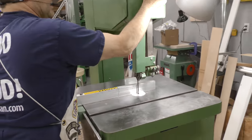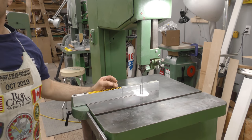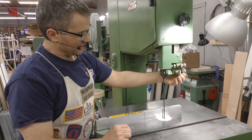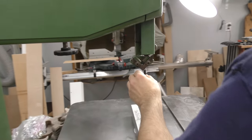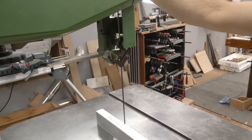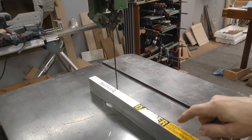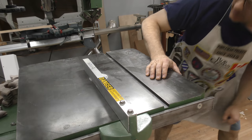They've got this weight that goes on a cord — a piece of steel wire around a pulley into a big weight down here, so when you lift the upper section, as heavy as it is, it's counterbalanced. Now I've got to make sure this thing is perfectly aligned — and it isn't. The guides need a little work. I'm going to try a block of wood, slice it off, to see if the bandsaw fence is set up and if this thing is running true to the fence, because I don't want to find that out when I'm cutting the cherry.